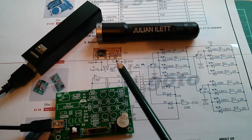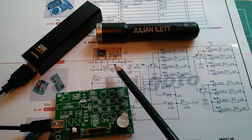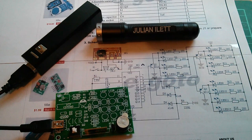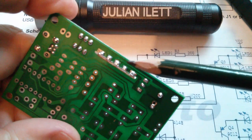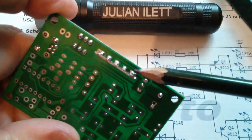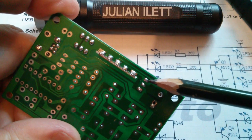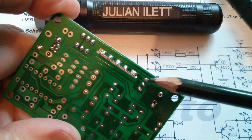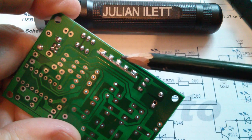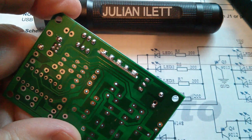So I'm going to put one in and go for something like 10k — I've got some 10k resistors to hand. I'm just going to cut the base leg; I might even cut the track on the PCB. I'll really go for this and stick a 10k resistor in there and see if that fixes the problem. So this is the track I need to cut — it's the output of the music module, this center pin here, through this thin track running to the base of the transistor. The base seems to be on the outer pin here. So I'm just going to cut that and then solder a 10k resistor from that solder pad to this solder pad.